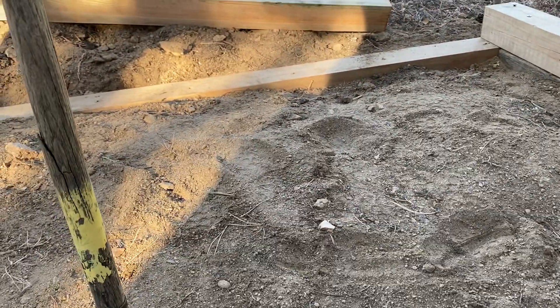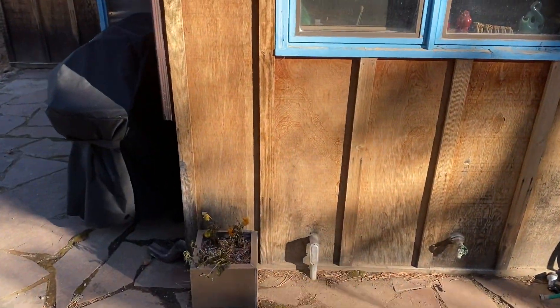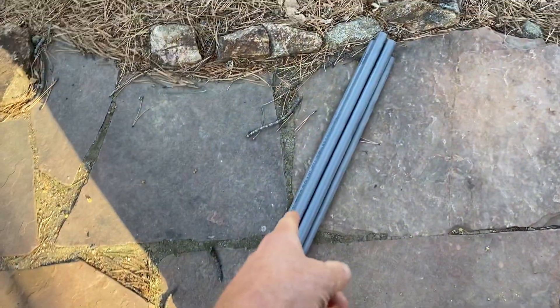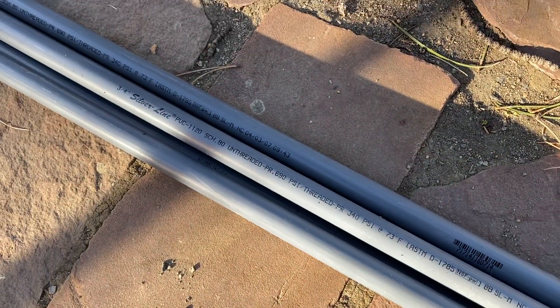You're good to go and put a hot tub on it. Then I was going to look and see where your electrical panel is so I can shop around — I wonder if we could somehow tie in right there and chase in and get into our electrical that way. I see you have some conduit here — this is schedule 80 which is ready to go above ground.